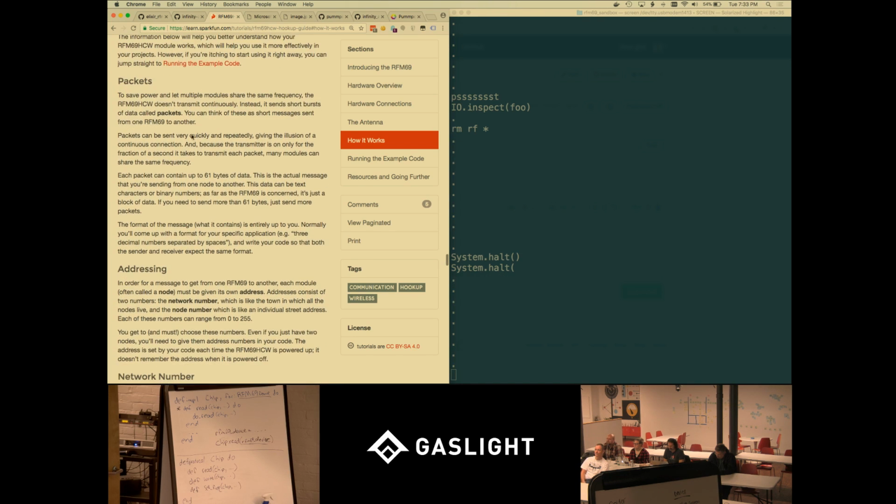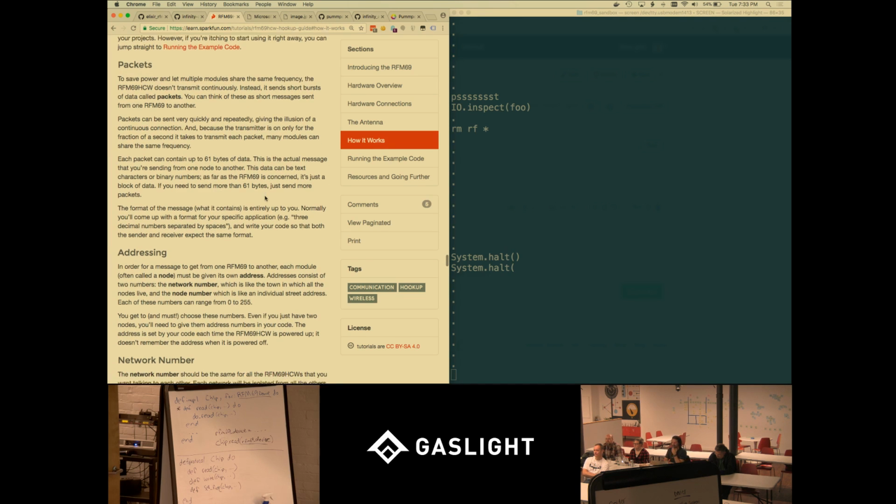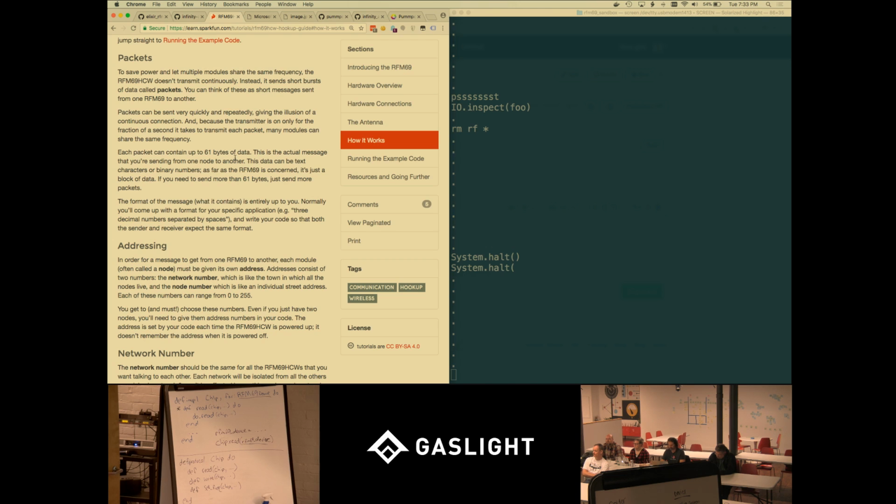The RFM chip specifically has on board a default behavior of doing all that data whitening and everything. It implements retries and stuff, I think, on the chip itself. So if I wanted to send you a packet and reliably get it to you, I wouldn't necessarily be using all of that configuration that I sent to you. That's specific to make it talk to these other chips. But those two RFM chips could talk to each other out of the box with less configuration, and they would have retry of the packets if nothing got ACKed. It's basically a hands-off control mechanism where I can make sure that a message gets to you. Yeah, that's super cool. But I don't really know how to use that because that's not the world I've been living in.